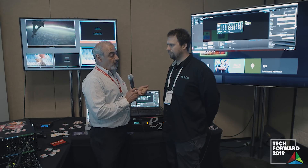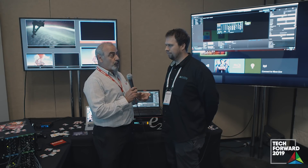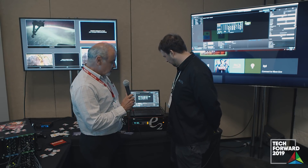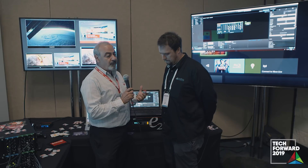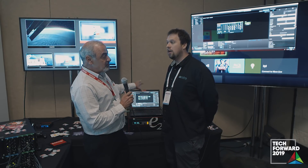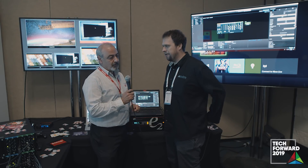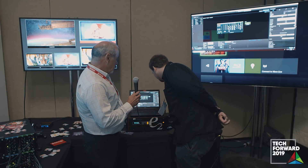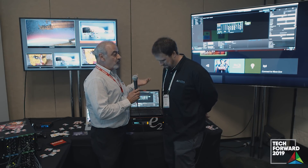So a total of 16 4K inputs. On the output side, all slots already supported 2x4K — so 6x4K with multi-viewer or 8x4K without multi-viewer. It's also a refresh of the product addressing some end-of-life obsolescence. After five years of shipping the product, we had to refresh it a bit. New CPU and new power supplies to ensure it's fully redundant because it is loaded with the second generation cards. That problem has been solved with this new Gen 2 system, and it is available as of September with release 7.0.